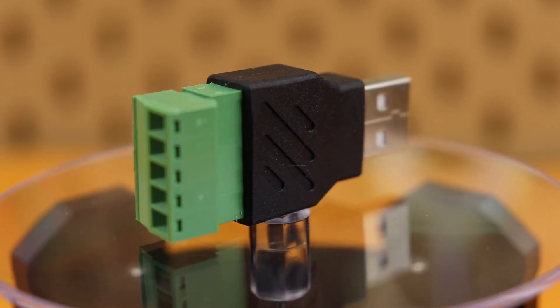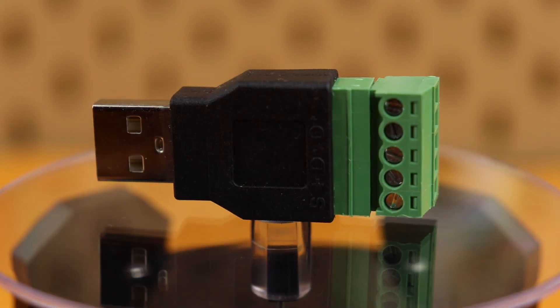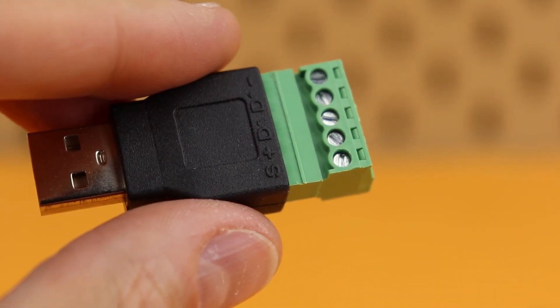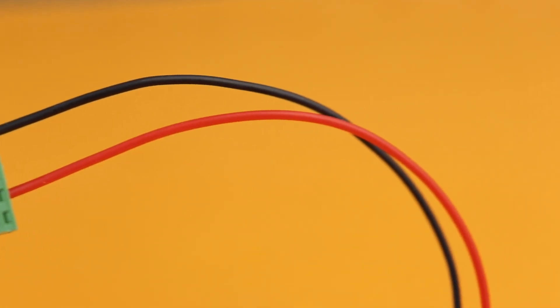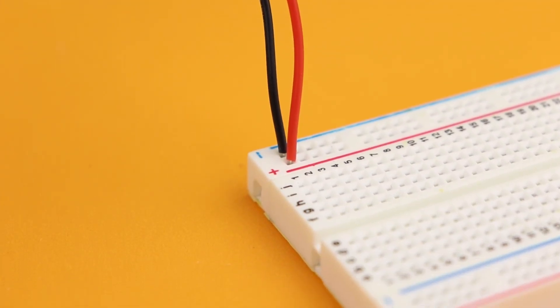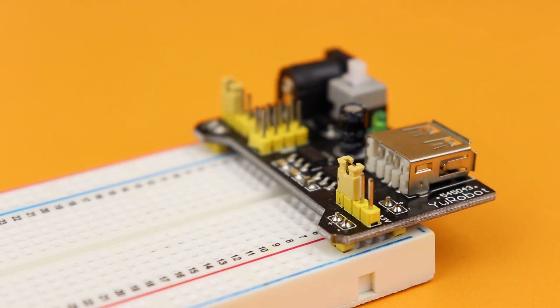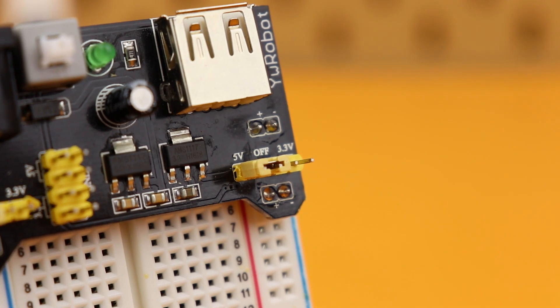This makes our system very easy to use but also very flexible. Now, how do we get that power onto our breadboard? That's actually two questions: first we need some sort of wire from the USB cable onto our breadboard, but USB always works with 5 volts and maybe we need 3 volts or 9 volts or 12 volts. If you really only want 5 volts you can get one of those USB breakout adapters to directly access the +5V and ground connection straight from a USB cable — just connect two wires at plus and minus and plug those straight into the breadboard. Or instead you could use these USB breadboard power adapters that plug right into the breadboard. Most of these adapters also give you the option to set them to 3.3 volts, which can be useful sometimes.